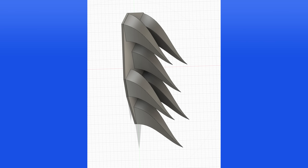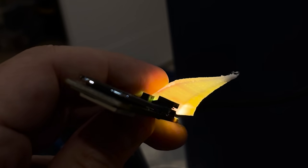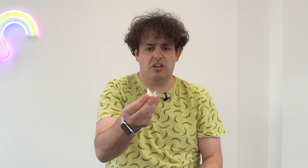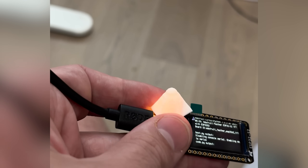To start off, I went into Fusion 360 and tried to design something, and then made a few 3D prints. The key to 3D printing things when you want to make a big thing is to start off small and make lots of test prints. At first I printed out one spike, but that didn't show much light through it. So I went with another one which is much hollower. I'm using a type of filament called TPU — thermoplastic polyurethane. These were a little bit frayed at the ends with a lot of stringing and it went a bit wobbly, so this didn't turn out so well. I refined the design slightly and made some taller spikes with hexagonal bases, and this one came out much better.